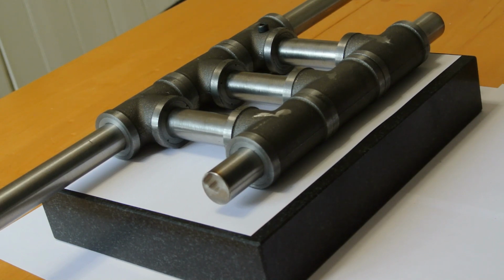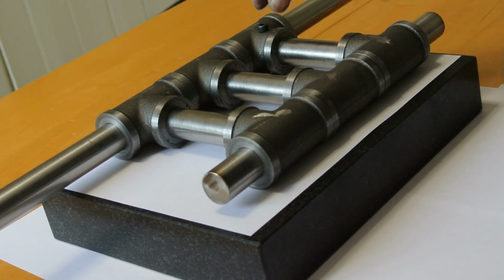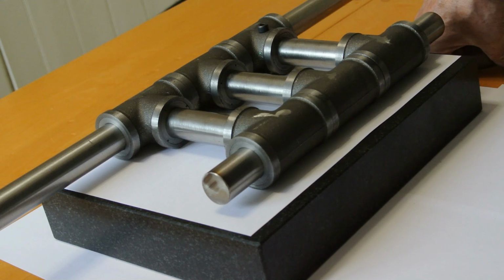What I shall do next is I'll drill a little way down with the final size. I did them in 1mm steps up to 12.5mm. So instead of doing that, I did them like that. Each time I run a drill through, I'll take the drill out, and then I'll only do the drill down a modest distance. I won't go right the way down, and I'll clean up any drift that's happened with the end mill or slot drill, and just run it down. So I should be able to control that in the lathe, in the mill.